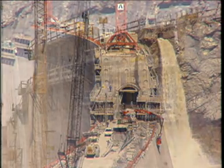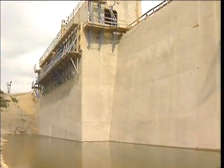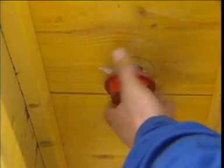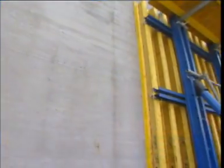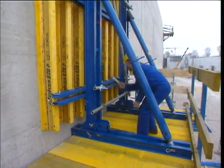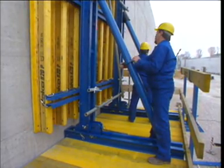A system that is complete, safe and economical. Now let's look at some practical examples that will show you just how quick and easy it is to use. The first step is to undo the positioning anchor — simply unscrew the cone bolt and the formwork element is released. The formwork element is now pulled off the concrete. This is simplicity itself: just knock out the wedges with a hammer and turn the spindle to tilt the element back.